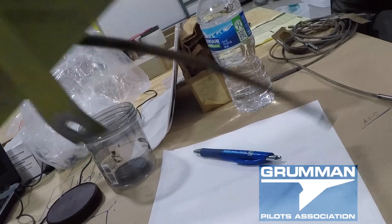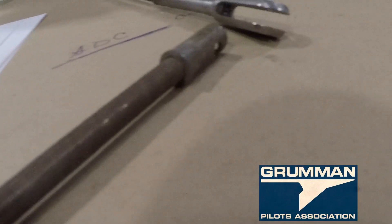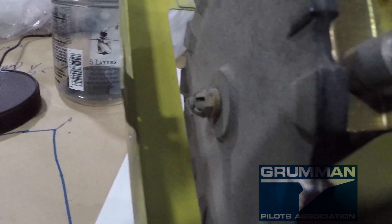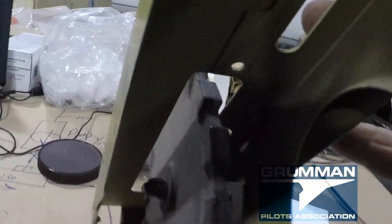The trim wheel has a pinion wheel. Let me flip it over — here's the trim wheel, and on the back side as you can see, as I spin it, that wants to rotate. Now let's go over here and look at the pinion. If I rotate the cable it all connects together. What makes the pinion gear hard to change is right up in here — you can see it turn against that wheel. Up at the top, here's how the pinion all meshes together.